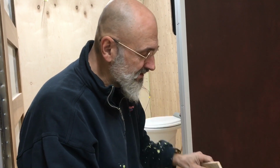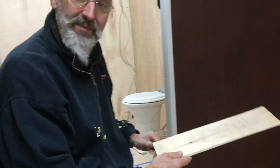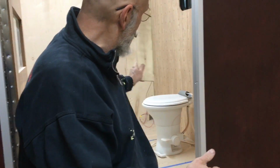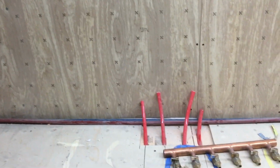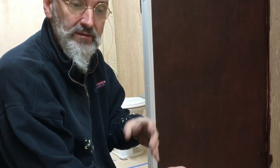The other loop, a little longer to explain. We take it from here, we bring it into the bathroom. From the bathroom, it will go into the bedroom. From the bedroom, it comes back, goes into the basement, heats the basement where we have our water system, brings it back up, and then finally into the tubing we put into the floor at the beginning of the build. That tubing, or in-floor hot water heating, should never exceed 100 degrees Fahrenheit.